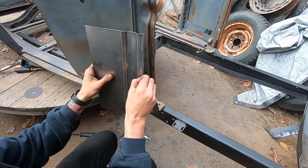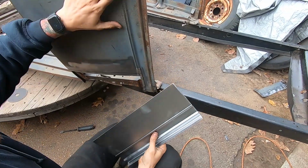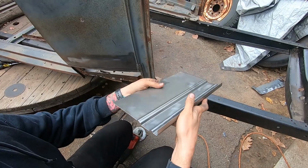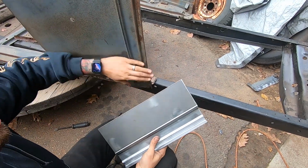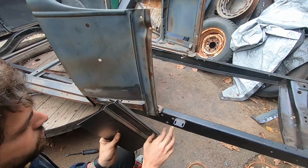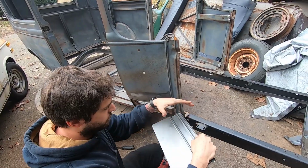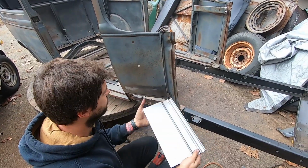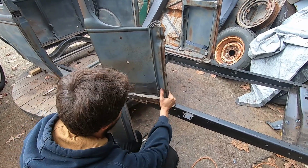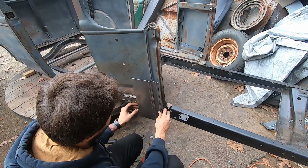But it's straight. Oh, that's also a good and a bad thing. But I can put curve into this panel and then pound it out slowly, and then it should be the same curve as I started with. Yep. Or I can always stretch this edge a bit, stretch this here, and it'll put a little curve to it. I'm happy there. And this end right here is pretty flat anyway. Yeah. And we don't need that much here.